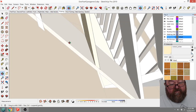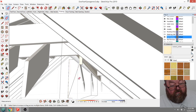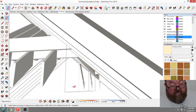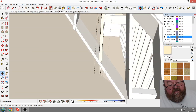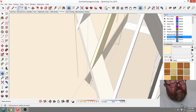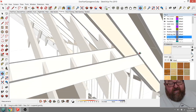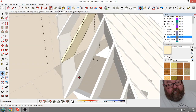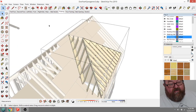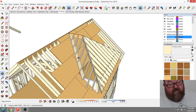Like that. I'm sure there's some junk under here that I haven't got. Am I going to take the time to do all that on all those? Maybe I'll do a couple of them. I see a piece I missed down there. Like I said, I could cut that off with a saw quicker than I could cut it off in CAD. The way this is funky, it's got that compound bevel on there like that. But I promise you, cutting all these rafters off just to sit on that is much easier than trying to cut a compound valley.